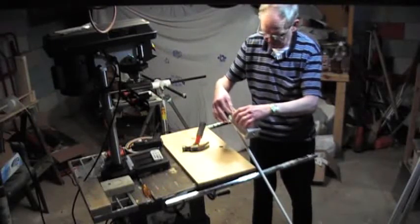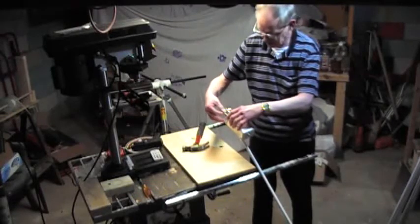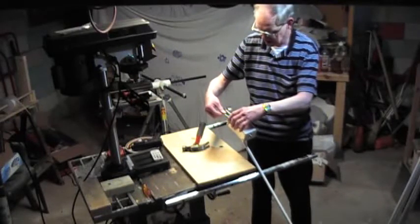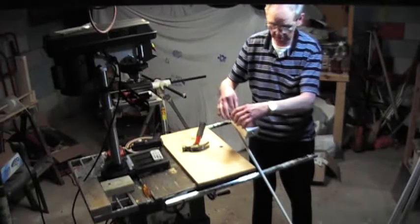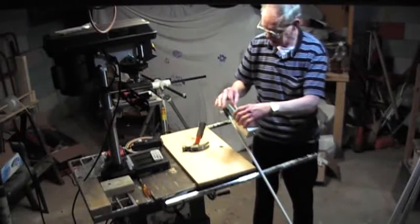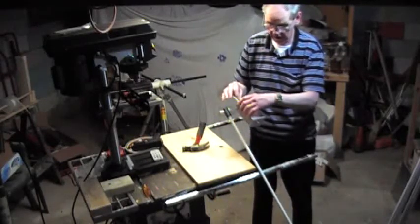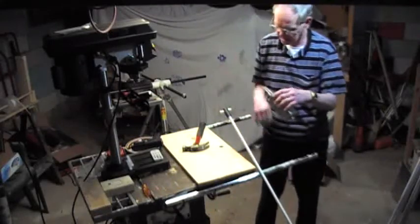There's some coaxial shield that goes over the top. This one comes up to one side and it's just locked in place. The other one — the shield — is movable, and that's how you adjust the SWR, by exposing more or less of this final wire. It helps to have an SWR meter, and it'll work out pretty good. Mine did last year.